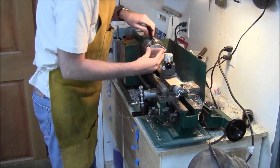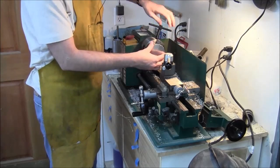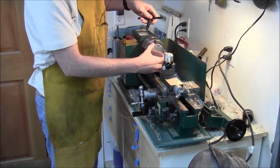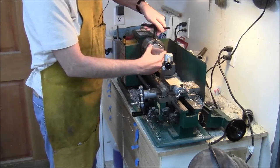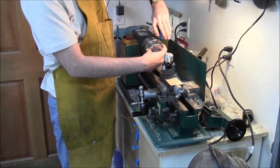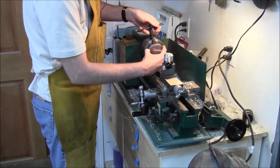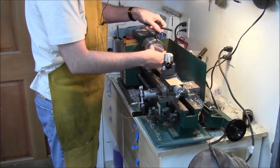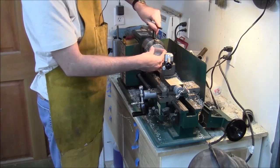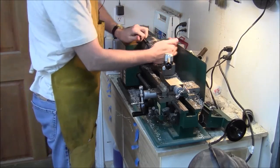center here. Okay, so I'm just going to, this funny shape is because it was a cutout from when I built my CNC router. It was one of those situations where you want to cut a big hole but you don't have a big hole saw and you didn't have an easy way of doing it. So what I did was I marked where it was to get drilled, and then I drilled tiny little holes around the perimeter, basically to perforate the perimeter of the hole.